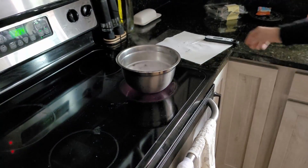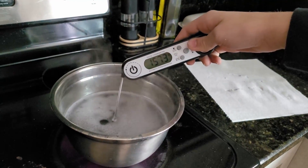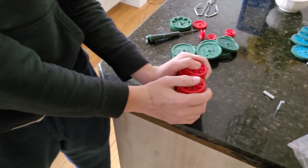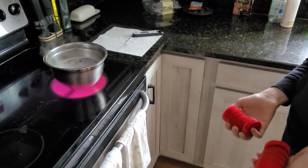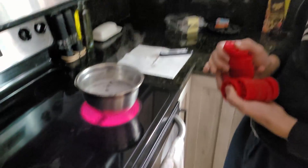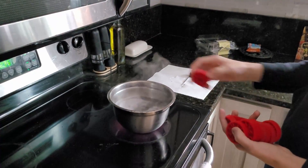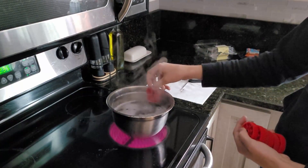Once we have our mixture to a boiling-ish point it will be at like 150-160 degrees, and this is just going to be slowly heating up. We can start to add our parts — we can do any plastic VEX parts like gears, wheels, flex wheels, spacers, or anything like that. Just try not to splash this on yourself, but you can really just do as many parts in here as get submerged.